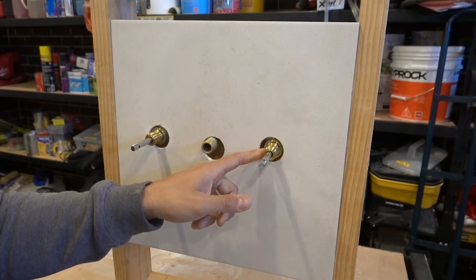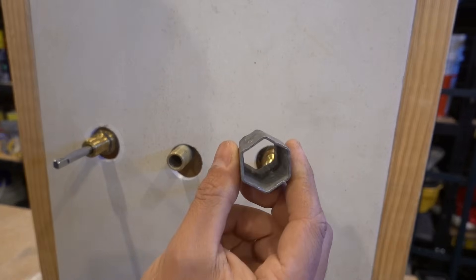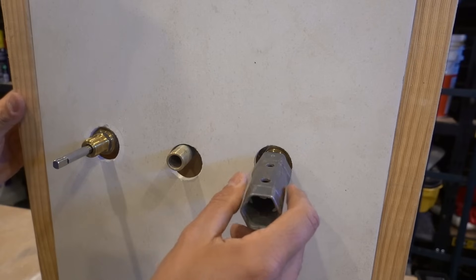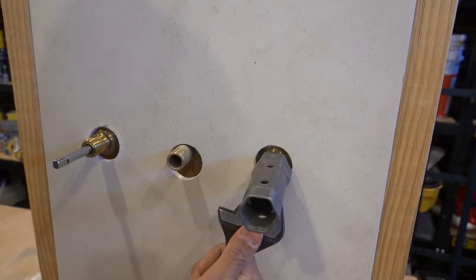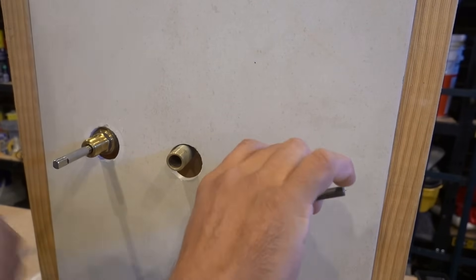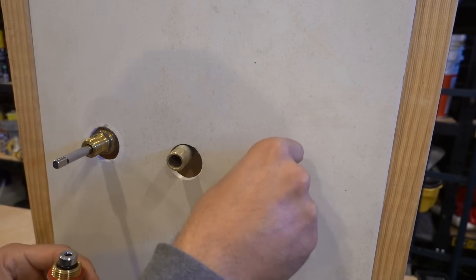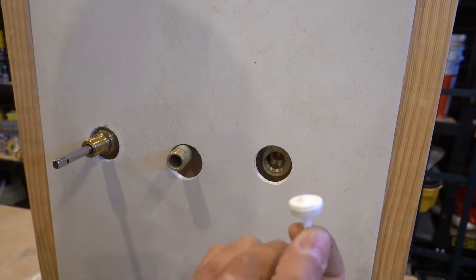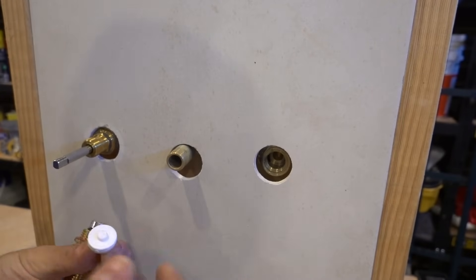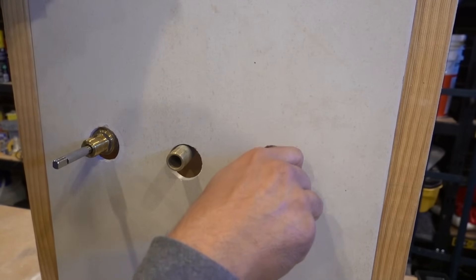A lot of the time it's very tight and there's not much space, so you won't be able to get an adjustable wrench in there. If you're struggling, what you need is a tap spanner — it's hollow all the way through so it slides right over the top. If you need more leverage, slide on the extension and use your adjustable wrench on the outside or the included rod to twist to the left. Once it's loose, continuously unscrew it and you can see the little washer right there in the middle. Pull it out and check if it's worn — if there's a big groove along it from over-tightening, simply take a new one, drop it on top, and reinstall everything back the way it was.